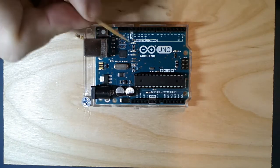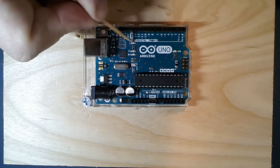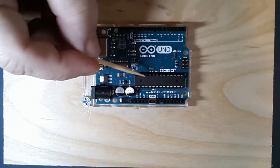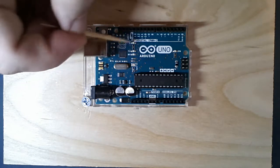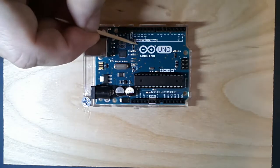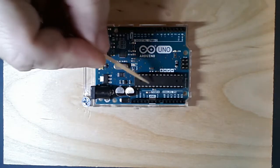There's a little LED here that is red and you can actually program it - that's one of the first programs we're going to write, making this LED turn on and off. One of the pins on the microcontroller is going to turn that LED on. If you looked at the schematics, you'd find that one pin of this LED works its way back through the traces to one of the pins on the microcontroller.